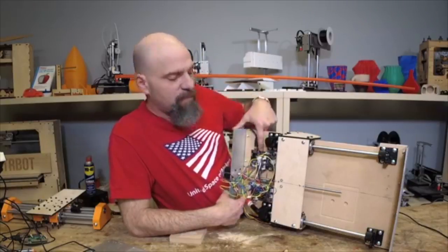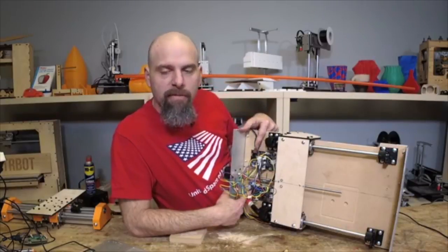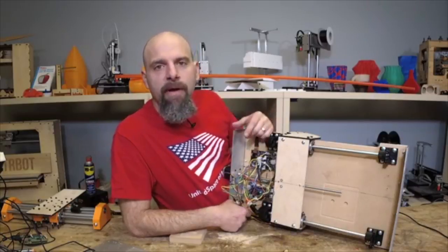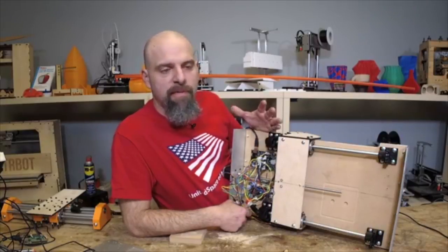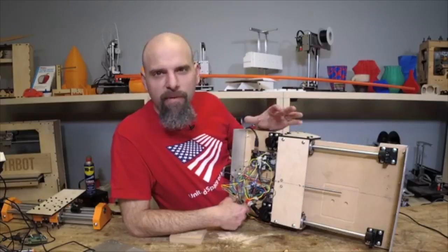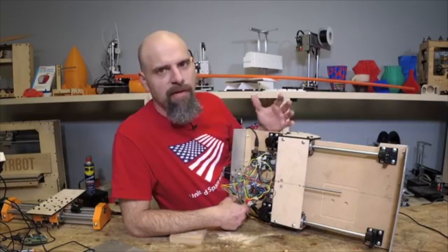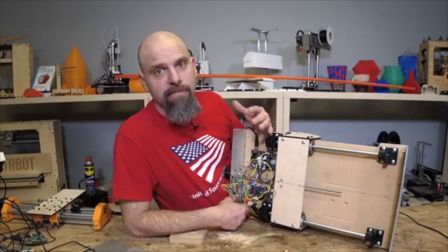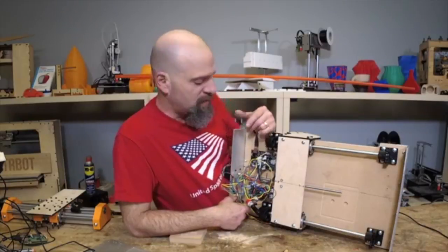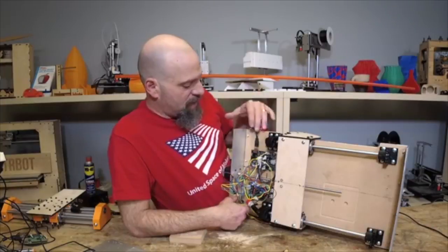But really, Tiny G started in CNC. And so their firmware, completely out of the box, the same firmware that runs our printer, can accept CNC commands, and there's no weirdness like, well, I'm using Marlin to do CNC. No, you can use a real CNC host software like CNCJS to run this Tiny G board. So anyway, I'm going to test it.